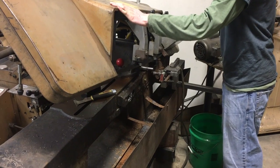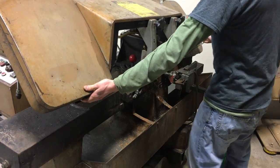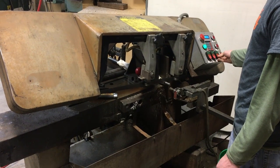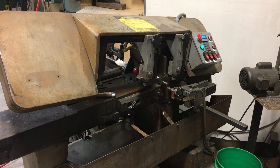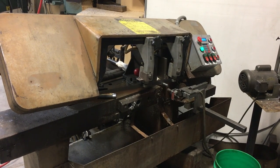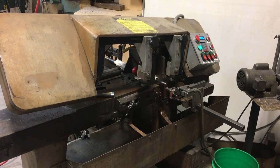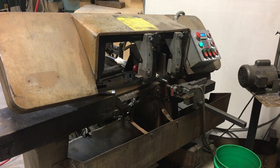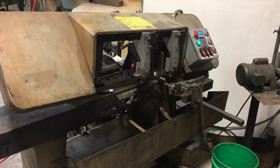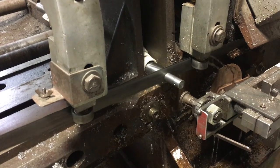So we found that the turndown section of shaft where the hand wheel was mounted actually was quite a bit off center by almost like a 32nd of an inch. And that could have been causing some of that bouncing that I mentioned before. And that would have been made worse by the fact that we only had the one rod. So we're just going to cut that off and start from scratch. So the next prototype won't open quite as far as I wanted it to, but that's okay for demonstrating the final proof of concept. It's better than buying another threaded rod. They're expensive.